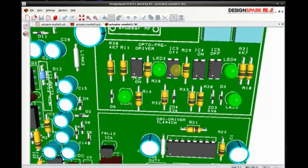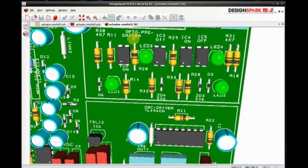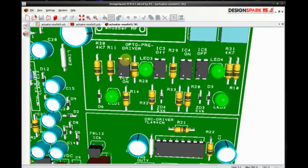I mean, it's using the opto isolated chips to drive the output stage, but that's mainly just to prevent noise from getting back into the oscillator section, which is down here. Because if you have direct coupling, and because I'm pulsing coils, as you probably saw in the previous video, the amount of back EMF and pulses and RF is a big problem. Well, the best way to get rid of RF is to opto-isolate it and decouple from it. So hopefully the opto-isolated circuit will keep the RF from getting into the critical oscillator section here.